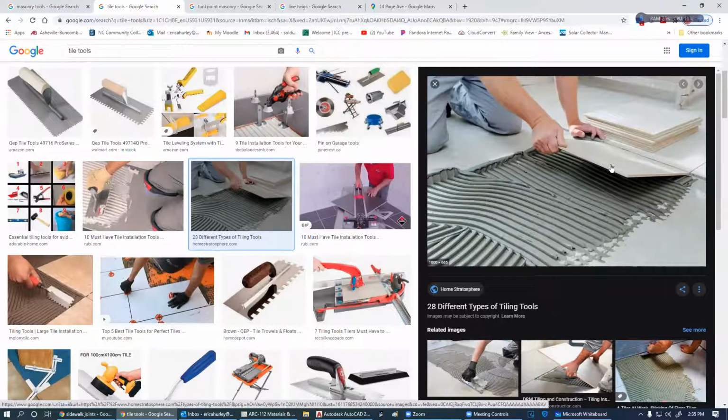I tell you, tile comes in different types. You can have ceramic, slate, marble, granite, all sorts of things. Ceramic is man-made, and I'm thinking that there's some more out there, but I can't put my tongue on it right now. They used to make them out of countertops, but it's a lighter weight material that has a little bit of flex. But for the most part, most tile is super brittle, so you don't want a whole lot of movement. When you're putting it on wood, you want the mortar to take the impact and not your tile work.